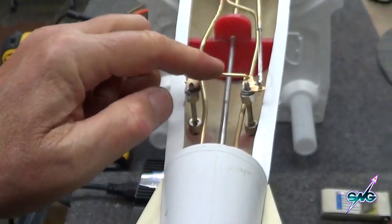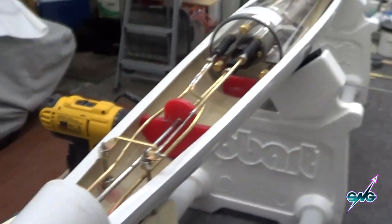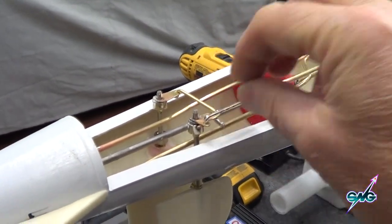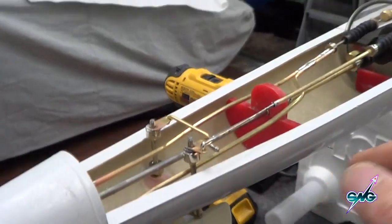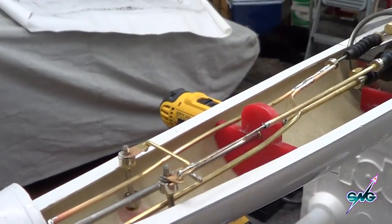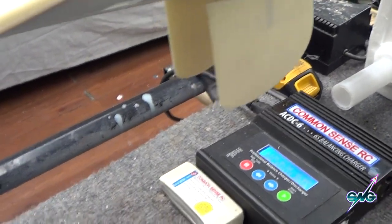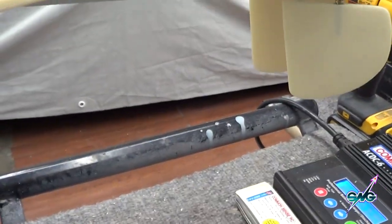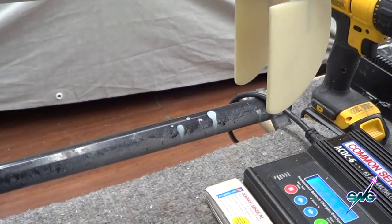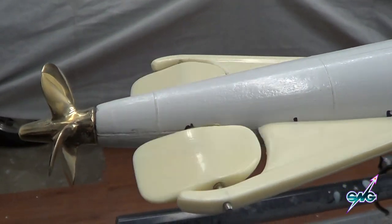It's Wednesday and I'm still on the submarine. I really want to finish this before going back to work on the film project. I got my brass in and we've got a much tighter setup. The solder there is to keep the Z-bends from floating — if they don't fit precisely, pull a bit of solder on top of them and then put them in — works every time. You can see just how much those rudders are turning without the servos in — it's a lot. Likewise we've got really good movement on these.